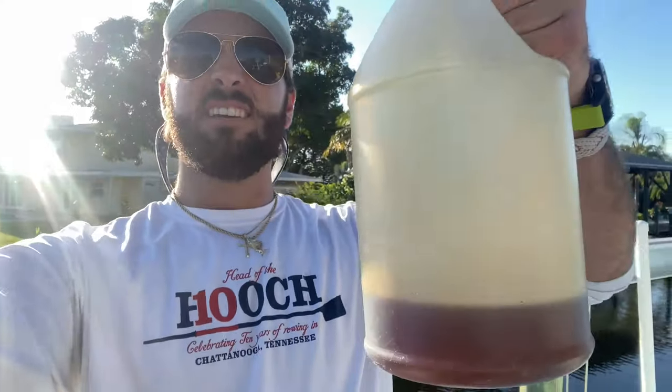All right, so you can see as of right now, I put in about half of what was left. I'm going to check to see what that got me, and then add more if I need more. And when you check, you have to be sure to take the funnel out, put that oil cap back on, trim the motor all the way up, let it sit for a couple seconds, then trim it down, take the dipstick out, wipe it down, put it in, and then check the oil. Do that every time you want to check the dipstick, just to ensure that you're getting a proper measurement.